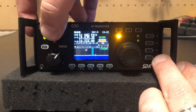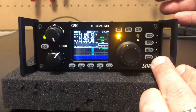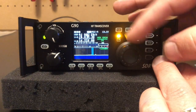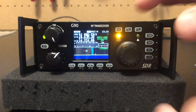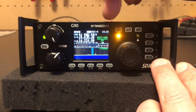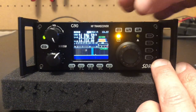Because this is a software-defined radio, a lot of this is in the menu. For example, if we want to use the Vox control, we push the function button — that light goes green — then push in the volume button. Vox is off, so we rotate our VFO and now Vox is on. Pushing again cycles through Vox gain, which we can adjust up or down. Push it again for anti-Vox — this is like a speech suppressant. And there's a Vox delay; I found 0.2 seconds is pretty good.